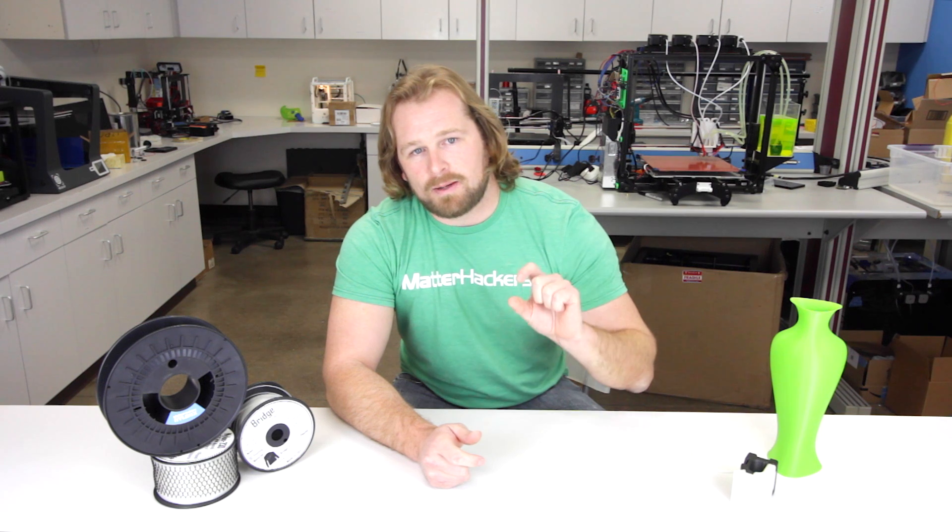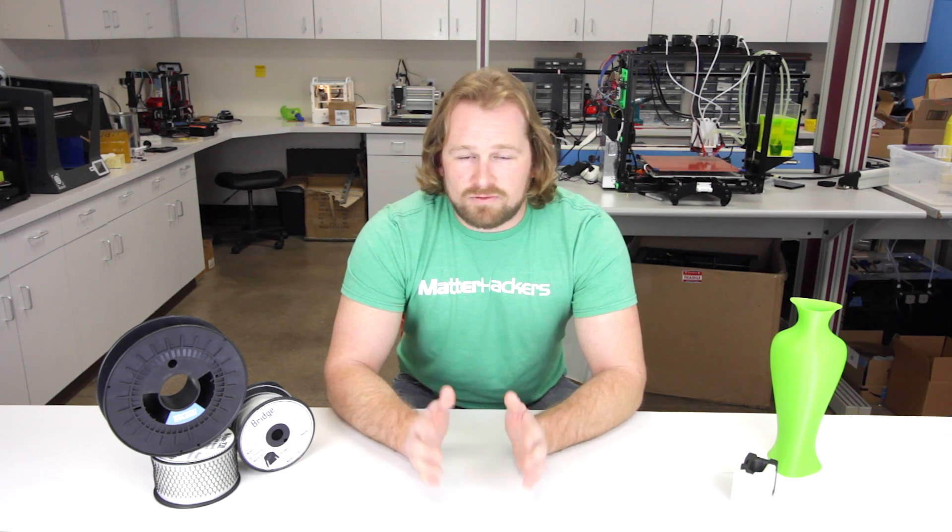First, let's start with why you might need an all-metal hotend. PTFE hotends — hotends that use plastic as the heat break — can really only go up to about 240 degrees C before they off-gas into poisonous gases. All-metal hotends that are engineered for those higher temperatures can go up to even 300, 310, or even much higher if you've got the right tool for measuring the temperature. Nylon prints at about 260 to 280 degrees, and that's right in the wheelhouse where all-metal hotends are really awesome.